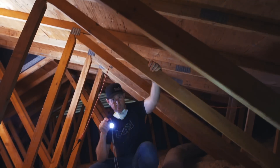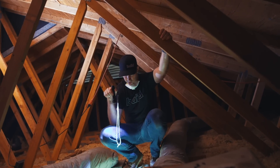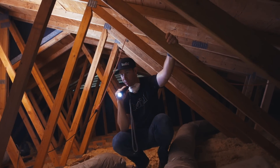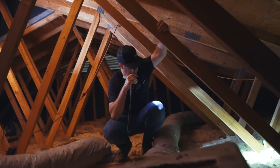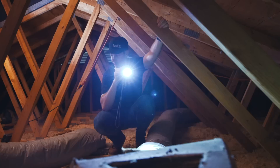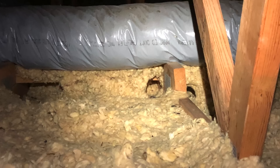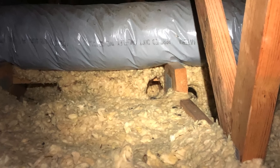There's very little insulation up here — maybe four inches at best, because all the bottom chord on these two-by-four trusses is showing. You can also see tunnels under the insulation where rats have just been running through.